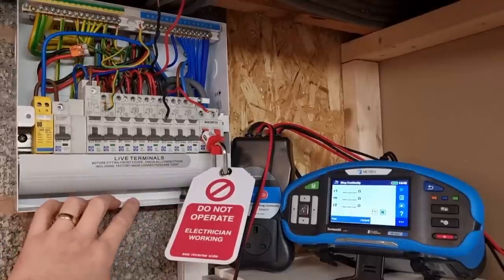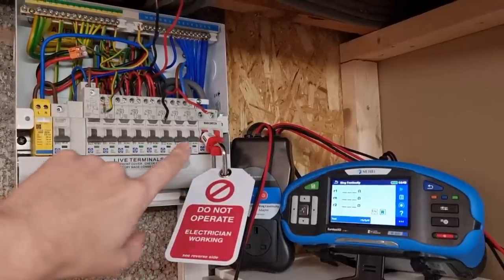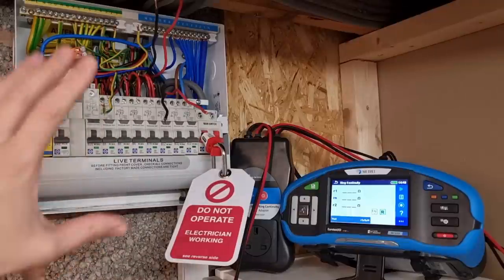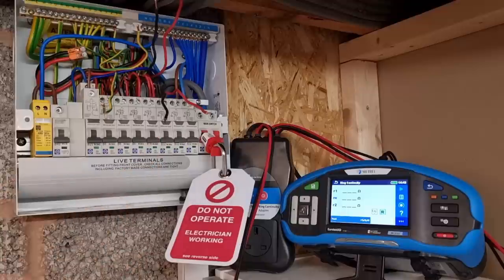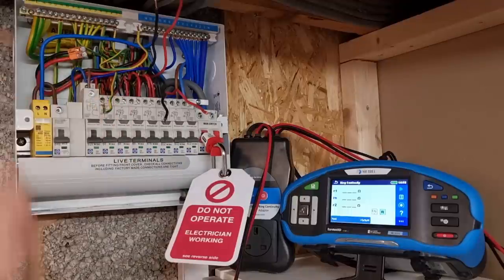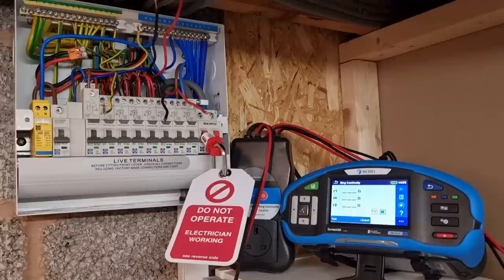This is the consumer unit we're going to demonstrate this on. You can see I've got it switched off and safely isolated, although the incoming meter tails are still live, but there's no lockable isolator further upstream from here. I'm quite happy with the level of risk and safety involved here — I can lock this room, no one's going to come in and accidentally poke anything in there, and it's IP2X so I'm not going to be able to access those terminals. If you're interested in safe isolation and how to achieve it, please check out our free training package over on the knowhow page of eFix.co.uk or by clicking the link in the description below.